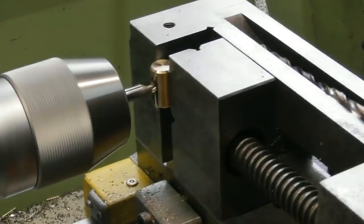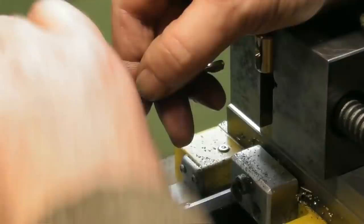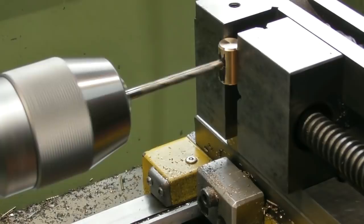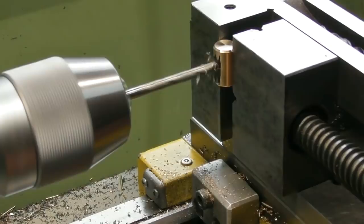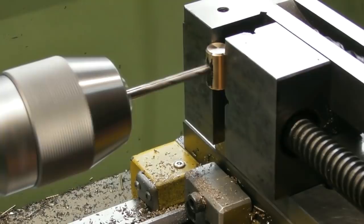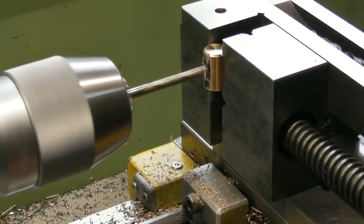I've set the little bottom swivel up in the usual way, as you've seen me do with all the others. I'm going to drill it through first — I've got a 5.1mm centre drill, and I'm going to drill it to 6.2mm to have a bit of clearance in there. I've got it sticking a fair way out in the vice. I'm not going to machine it exactly in half — I'm going to machine it until I've got like an 8mm wide flat on the top. I think that'll be more than enough — 8 or 9mm, I'll see how it looks.